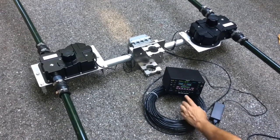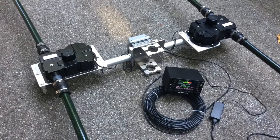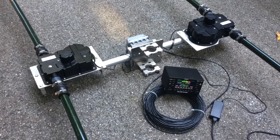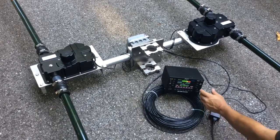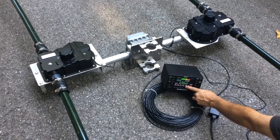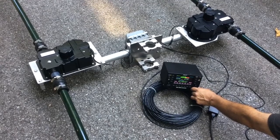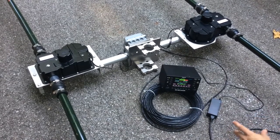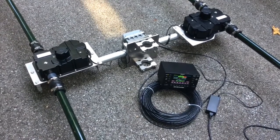The other thing you want to do while testing these motors is making sure the incremental tuning is working. Bring up 10 meters — the director's running, the driven's running, we're now in two-element beam mode. Grab this knob and as you change the knob position, it changes frequency. If you have the radio interface, the frequency may change with the radio. The antenna retunes by shortening or lengthening the elements depending on which way the frequency goes, to give you the best SWR. Make sure that in two-element mode (6 through 20 meters) those motors are changing as the frequency changes, and when you're on 30 and 40 meters in single-element mode that the single motor is operating as well.